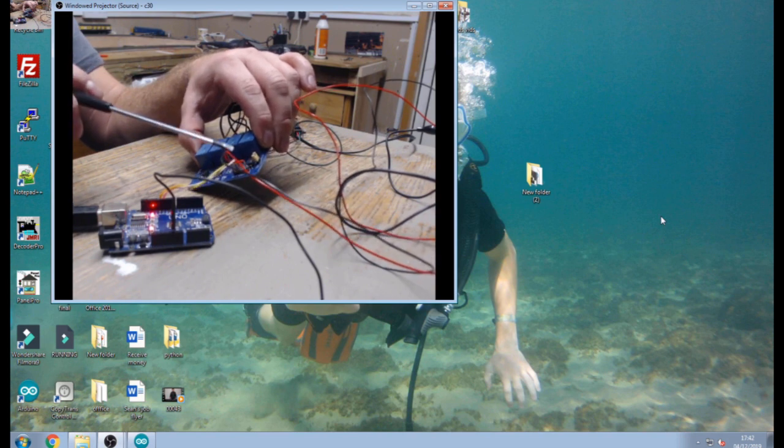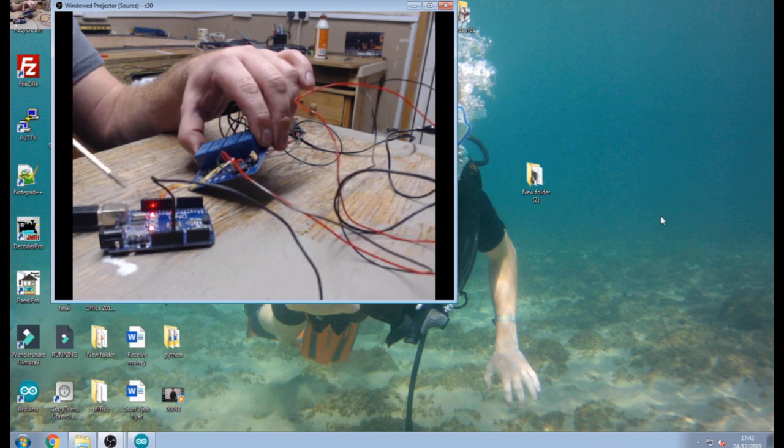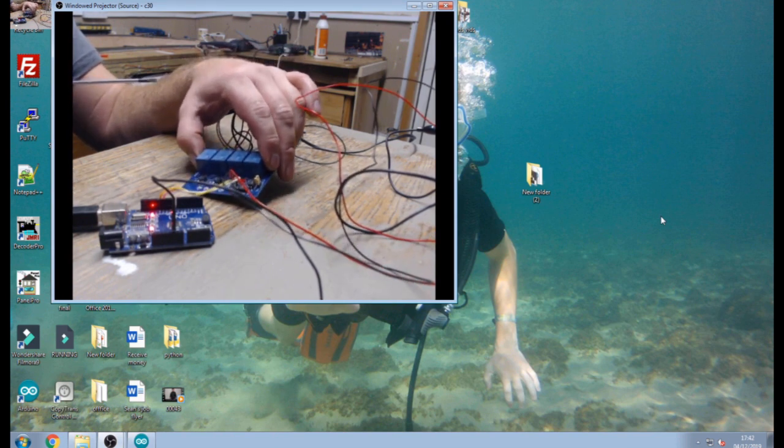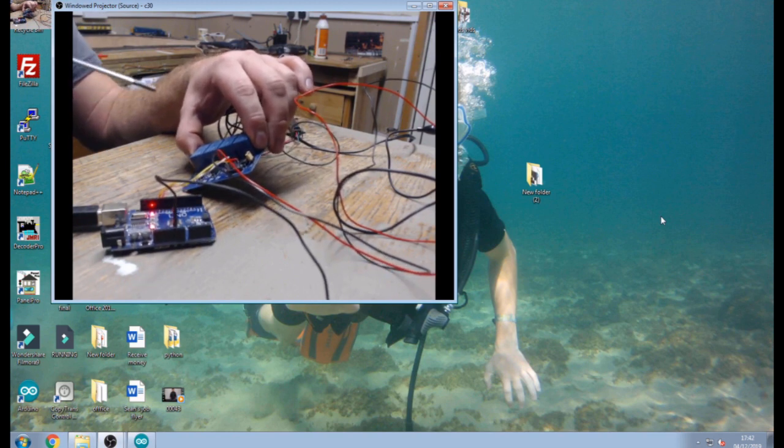Because this is separate and my Arduino is being powered by computer, I have connected the ground pin of the Arduino through a cable to my bench power supply, so I've got a common ground between both power supplies. This stops any problems with your code — if you don't have this connected I've had it where it just won't run, so it's worth connecting that up.